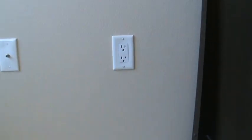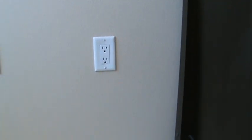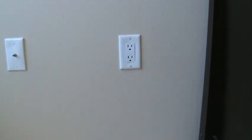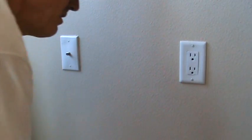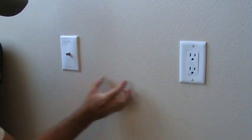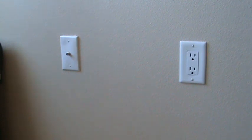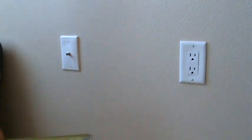And if I have to go over to the edge of that plug, that's okay — it's still pretty close to center of the wall. So what's our next step? We need to find out where the stud is. You want to do that a couple times on the wall. I'm over on the right hand side of that plug, and this looks like 16 inch center like I was saying before. There's probably a stud right there.